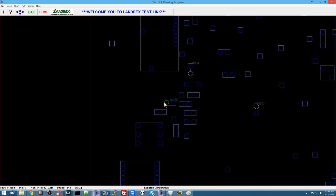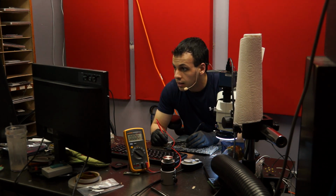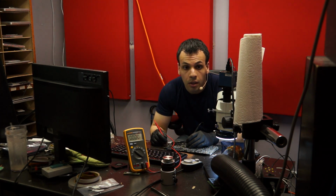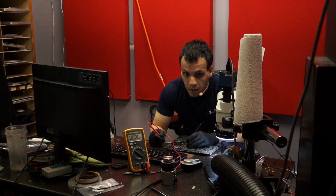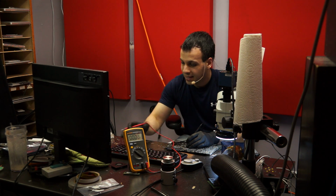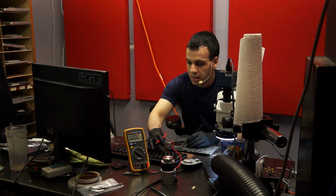So I go here, and now you can't see it. All right. I go here, and what do I get? I'm supposed to get PP3V42, and because I'm measuring in the wrong place, I get nothing. All right, let's try to measure in the right place. That's fine, though. The board view is upside down, as it always is.